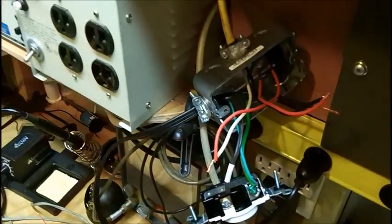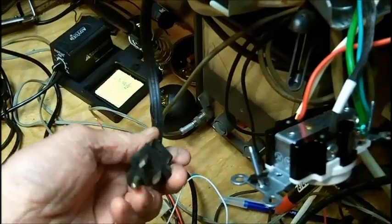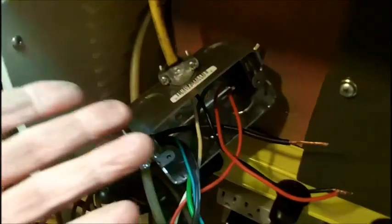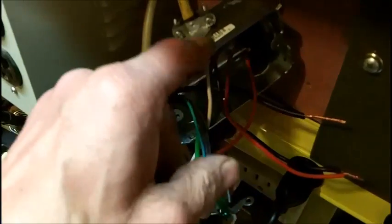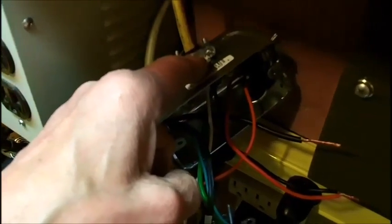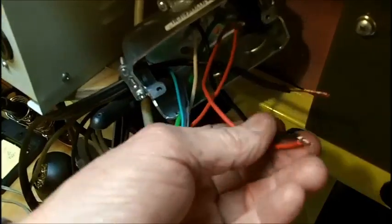Let me do that and I'll come back when I'm all done here. Now, this wire here is the hot wire coming from the plug. It's going to go through in series with the bulb. The bulb has a black and white wire, but there is no neutral or hot side strictly speaking, because the bulb is in series — you can say one's going to be hot and one's going to be the return. So these two get joined together with a wire nut, and these two red wires go to the switch, which go across the bulb. Actually, this is all hot — it's just controlled by the bulb. If the bulb is burned out, it'll be turned off, or it can be turned off or on with the switch. In a sense, this is all hot.